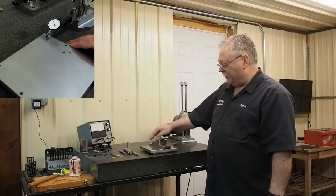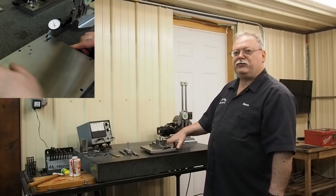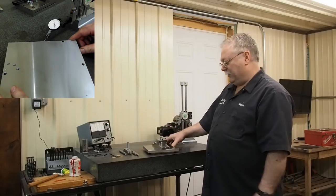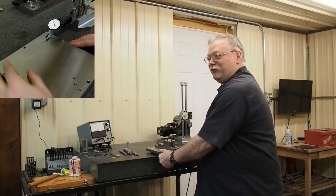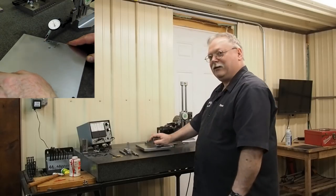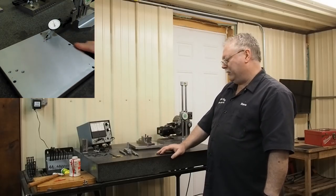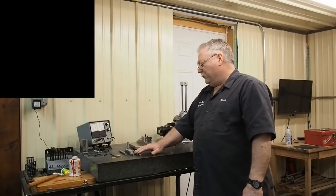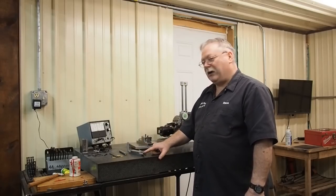You'll see that I'm measuring this plate and she had it ground less than two ten-thousandths of an inch — and it's flat. It's stuck to the table; there's a suction in there. You've got to really pull hard to get that thing to lift up. Real good job. They've both been a great help. We got the fixture made. We'll be able to do 3-inch boring bars. We'll probably do a video on the actual making of these pretty soon.